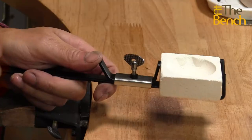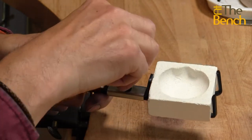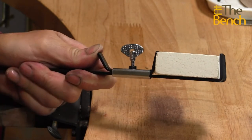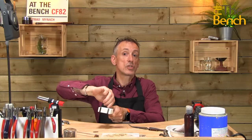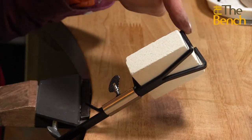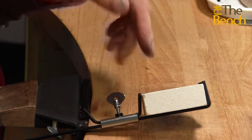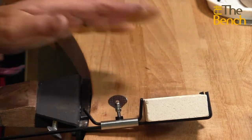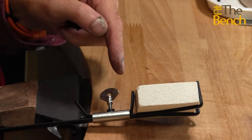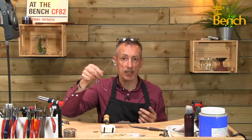Now what you need to do is not simply tighten that up because the crucible is quite tight but usually still loose. What I would be inclined to do is get your thumb and keep pushing this little slider up - forcing it up against the crucible, pushing it up - then turn the wing nut. That is usually sufficient to hold the crucible in place because these little claws are coming towards the crucible. Make this section upright or pointing towards the crucible so the crucible is being wedged into place.